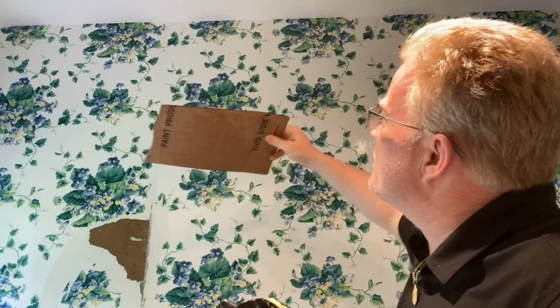All you're looking to do is prevent a tremendous amount of spray on the ceiling. Your ceiling's going to get wet. And you should expect to paint your ceiling, especially if you're dealing with stubborn wallpaper removal. But you don't want to soak the ceiling, and so you use a shield. Now I'm just looking to wet the seam, only the seam.